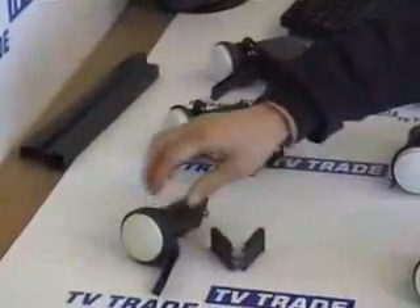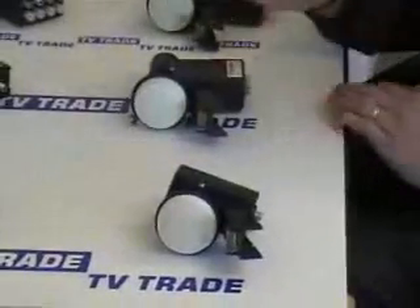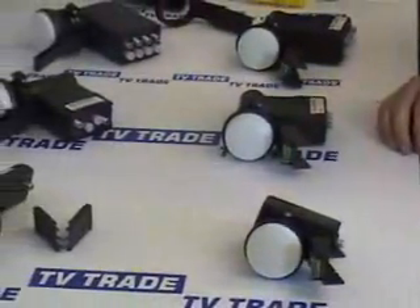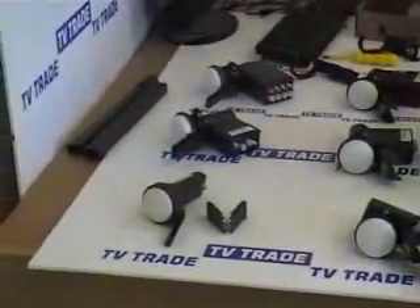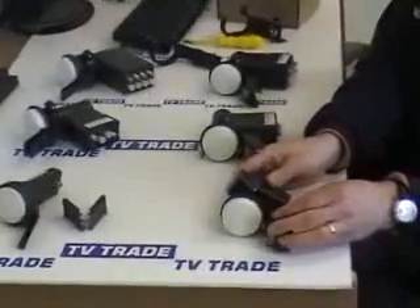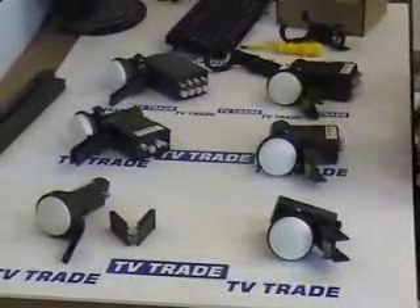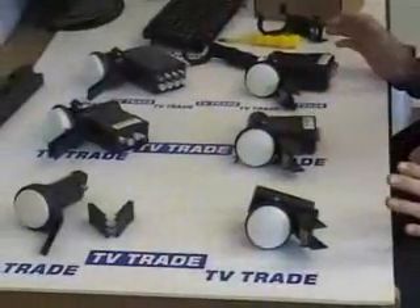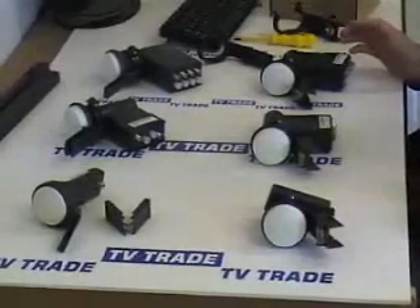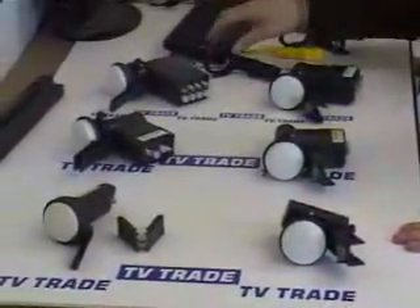The mark three LNBs actually slot into a Sky dish and the mark fours actually clip on. The reason there are two types is in June 2009, Sky actually changed the design of their satellite dishes. They moved away from the push-in ones to snapping ones, and they are easily recognisable because they have a little spirit level on them. I'm just going to quickly give you an overview of how both would be inserted into a dish. As a standard, it's only mark fours that are sold by the TV trade website. If you wanted to buy a new mark four LNB to work with an old dish, you would need to buy an additional product called a legacy LNB adapter.